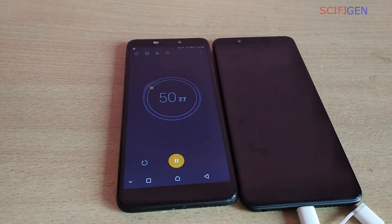The Quick Charge 2.0 specification uses the two data wires to allow your phone to talk to the QC 2.0 charger, to tell it that it is QC 2.0 enabled and what the maximum input voltage it can handle.